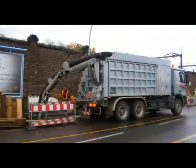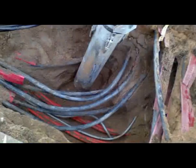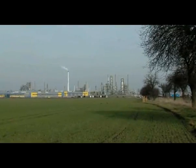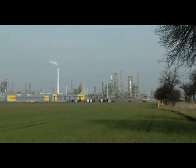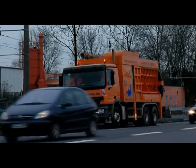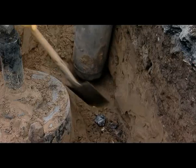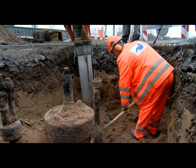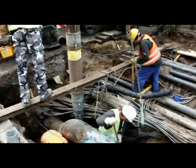The machine's extensive equipment allows them to be used in complete isolation from other units. Suction excavators can be used profitably anywhere where the high risk of causing damage excludes the use of hydraulic excavators or where the surrounding circumstances do not allow this. This includes sensitive industrial plant like refineries or chemical factories. The machines are frequently used for carefully uncovering underground plant and equipment like water, sewage, gas, electricity or telephone lines to avoid any damage, and for rapid emergency services for these supply companies.